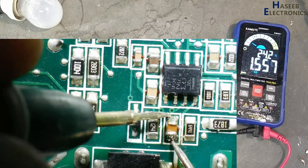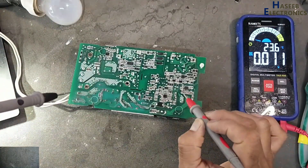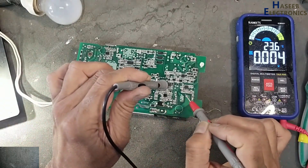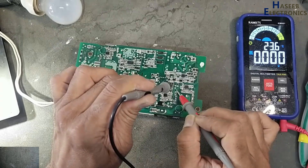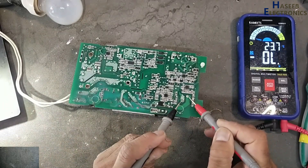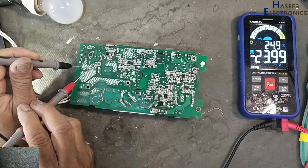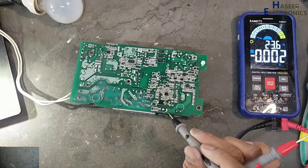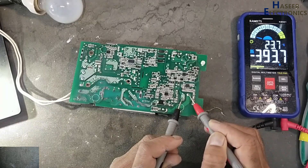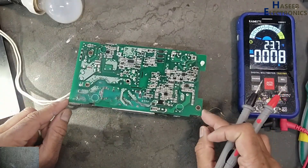With the original capacitor it was giving just 400 ohms, but now it is 1.9K. After replacing this capacitor, now here we have 10.43V — that's nice. We can see this capacitor was making a problem. PFC started; output is 23.99V. This track was damaged, this resistor, this diode — PFC section is maintaining voltage, output is good. Now this power supply has been restored to working condition.